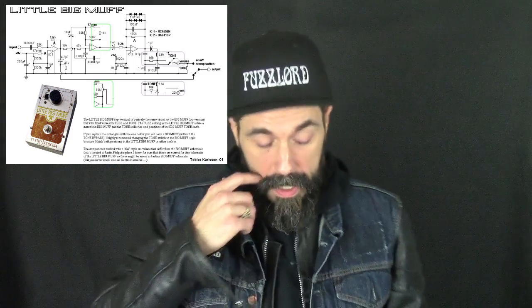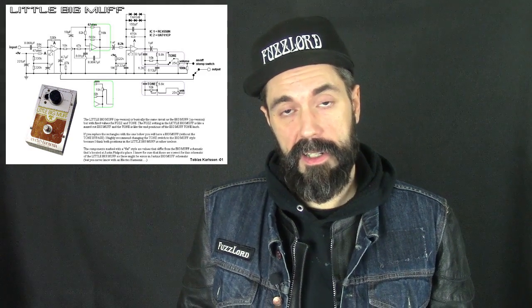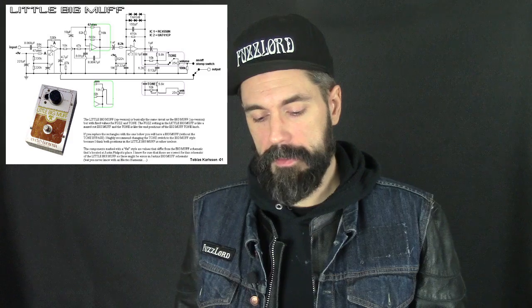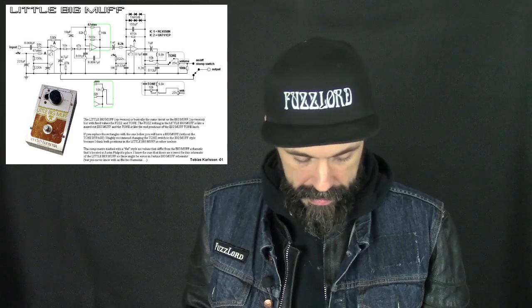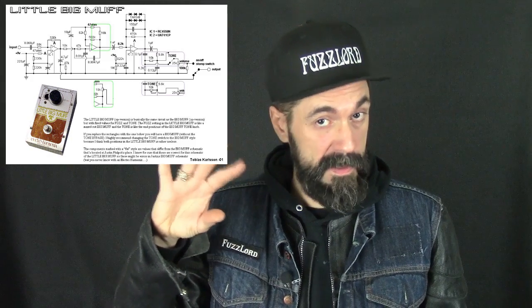Let's check it out. I forgot to mention that the version 7C Big Muff was non-true bypass. But this non-true bypass pedal is way crappier. Here's the deal that's going on. We see that IC1. Our signal's going to go into there, and it's basically acting as a buffer and a small boost stage. We're getting a boost of about 4.